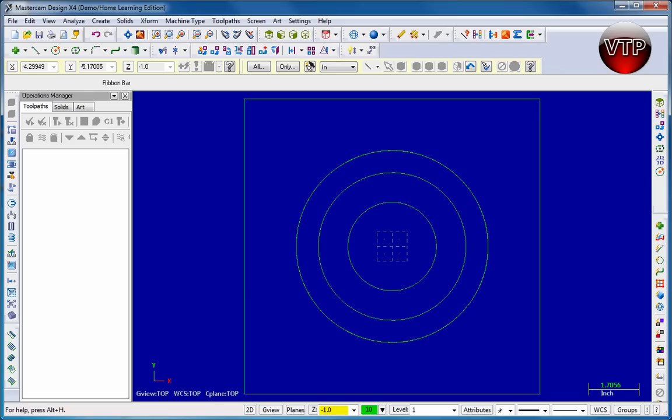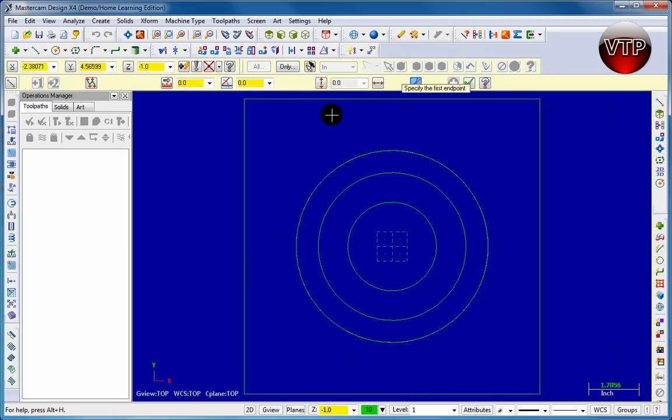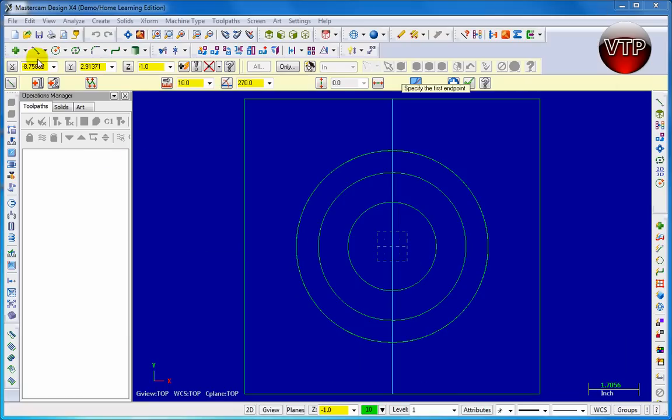Click Clear Color — now I have my circle at the bottom. Let's switch to the top view and draw the pocket. Going back to my sketch, I can see there's a line in the middle — that's my third layer at the bottom. There's a line in the middle and a little pocket. Let's draw that line first straight across, then I'm going to offset all of these lines — this one, this one, this one, and this one — about half an inch.